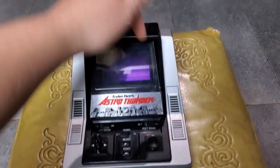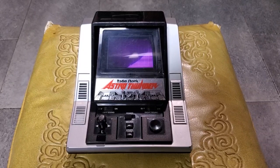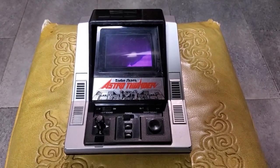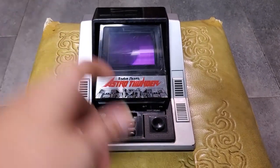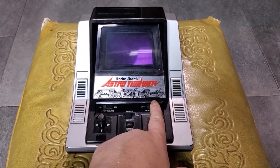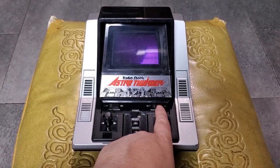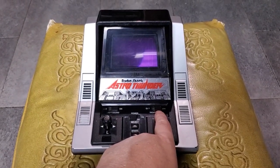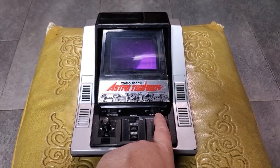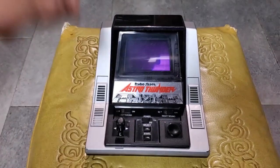The sound-making devices are actually in the back. There's actually two noise-making devices in here that do different duties. The waveform audio that I mentioned earlier is output through the right noise-making device, and that's controlled through this switch. And then there's a piezo buzzer separate from that, dedicated to just playing music. And that music is just square wave tones generated by the main microcontroller, and that's controlled by this switch here.